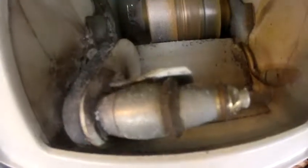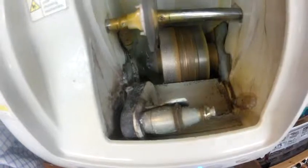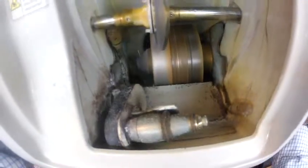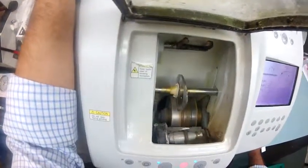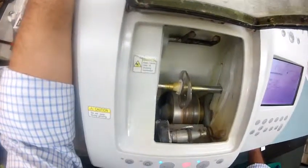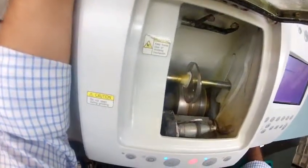The actual cutting wheel is down here on the bottom left. It's that lighter color wheel that's going to act like a heavy grit sandpaper to grind away your unbreakable lens material. This wheel in the center with that channel, that valley, that's what's going to put the bevel onto the lens so it stays inside the bevel of the frame. I will have to close the door due to the sound, but for now I just want you to see your prescription lens touches down on the cutting wheel.